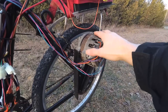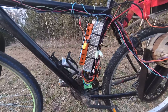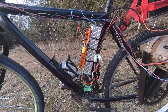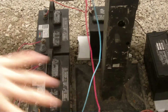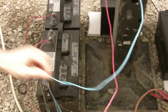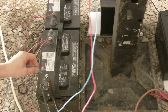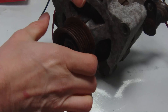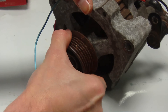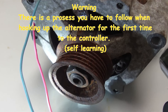Back when I wanted to convert an alternator to a motor, I never really bought things online until about two years ago, and the controllers were way more expensive. Now it's way more reasonable to do this — years ago they didn't have these dual mode controllers. Down here I have all my batteries in series, so we have about 48 volts. Now I need to connect the rotor power first because we need to create our magnet on the rotor. That's the rotor being energized — when I spin the alternator there's a resistance, just like there would be with permanent magnets in there. You can feel that resistance; it's quite strong. Big spark because there's some pretty big capacitors in here.